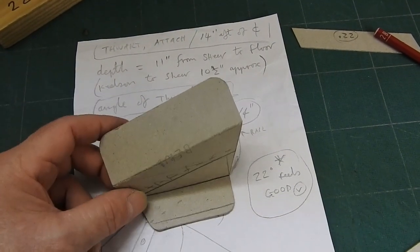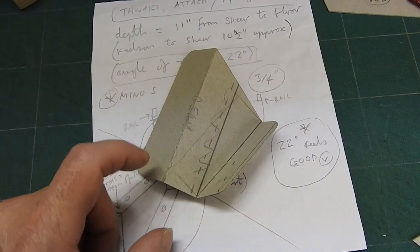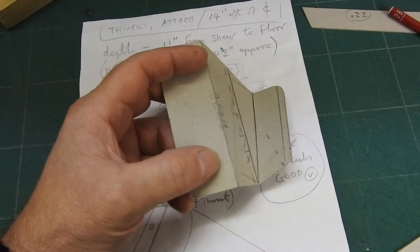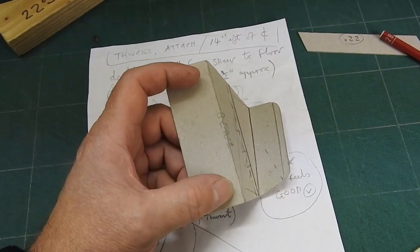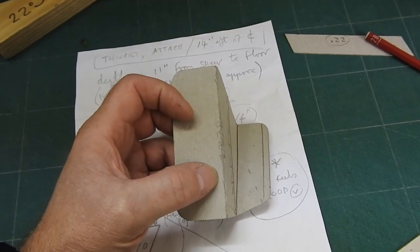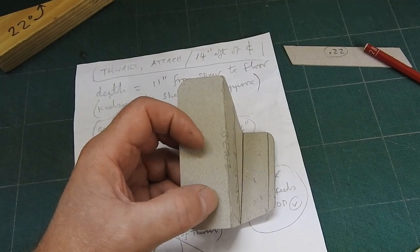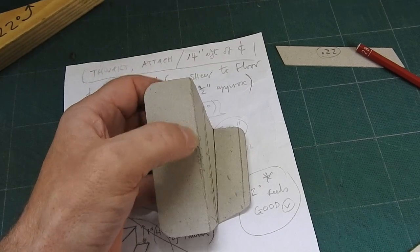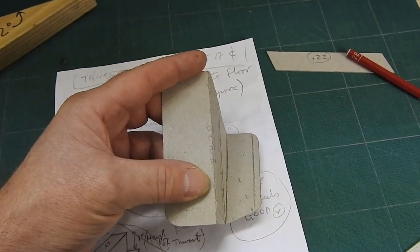And I thought what I can do is in the scupper hole, I'm actually going to put like a plastic block. I could do wood, I suppose, some more spruce, but I think plastic's better because I won't have to mess around with all the finishing and that. So plastic would be watertight, obviously, waterproof. So the plastic block can go inside that scupper hole, so when I drill the holes in for the bolts, it's not gonna move around at all. It's gonna be solid when I bolt it together.